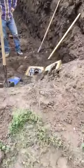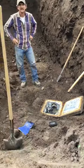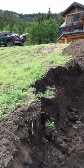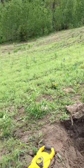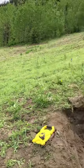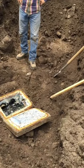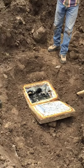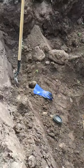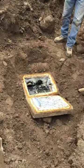We took measurements from the as-built. As you can see, it's buried quite deeply here. Unfortunately, a lot of backfill got pulled over the septic field and septic system, which you should never do. The distribution box should never be five feet below ground like this — that is a big problem.